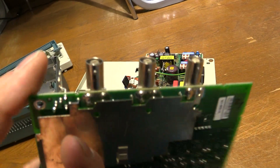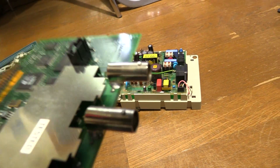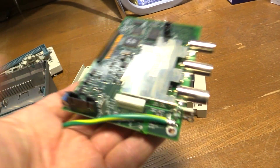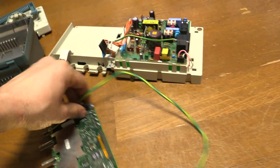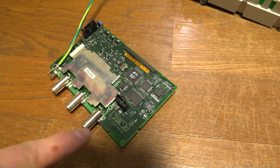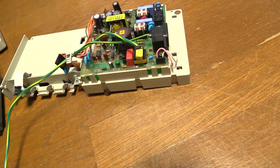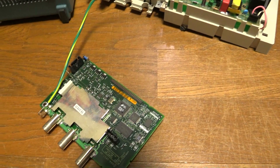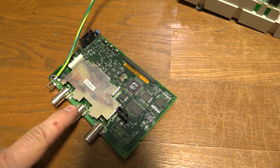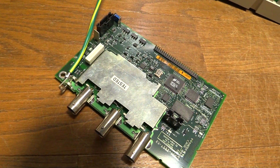Because if your connection is loose in there, it could be a bit of a dodgy connection. That's made those three really nice and tight. I'm going to connect this wire to here and I've got an awesome earth connection all the way through. So if you've got one of these and your BNCs are a bit loose, that's how you fix it — just solder on the top there, on each side. You will need a high wattage iron.